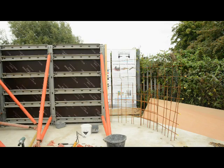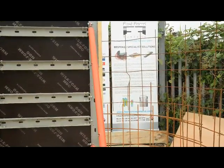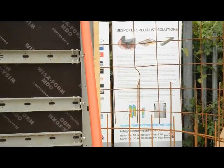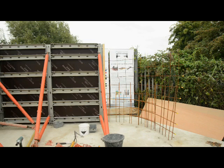That's the straight wall section finished for the inside. We've bolted a 4 by 2 timber to the last upright, set 12mm proud of the front face of the upright, to accommodate for the 6mm plywood that's now going to go around the radius, so that should marry up with the 18mm plywood already on the face. For the radius section we're going to use the 1.9 uprights, screwing a 4 by 2 timber to the face of each, because this time the 6mm plywood has to be screwed from the front face. We're not going to put the kicker props in as the system has been designed to work without those at 1.9. We're now going to switch to time-lapse.